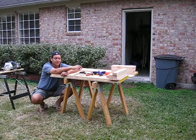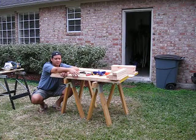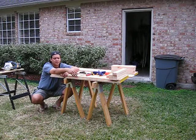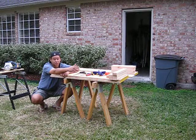What you're seeing on top here are two four-foot-long plywood boards and they're 16-inch wide. And below that, the two wider ones are actually 17-inch wide. Why 17-inch wide? Because these boards will be overlapping the ends of these ones. So these are each half-inch thick, that's why I need the extra inch on these side boards.